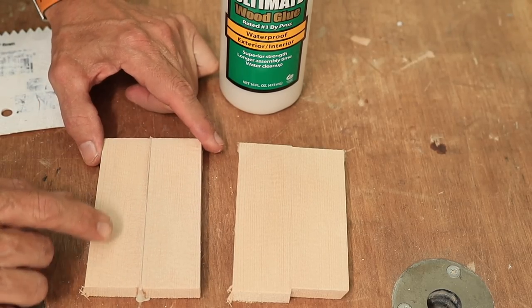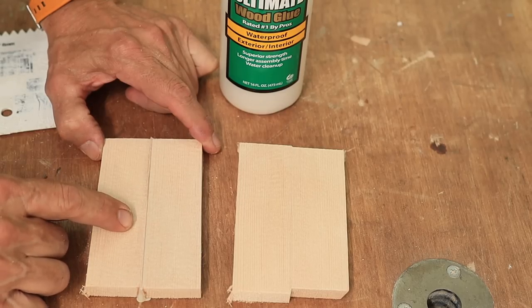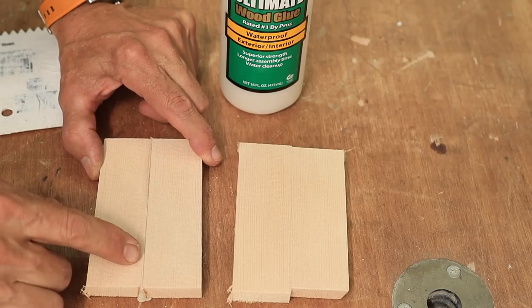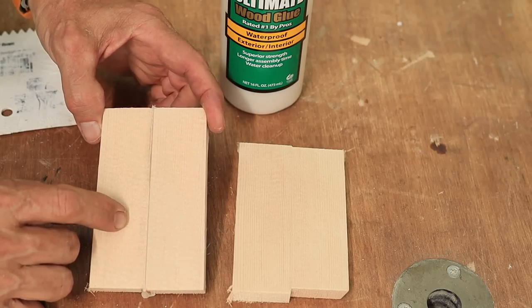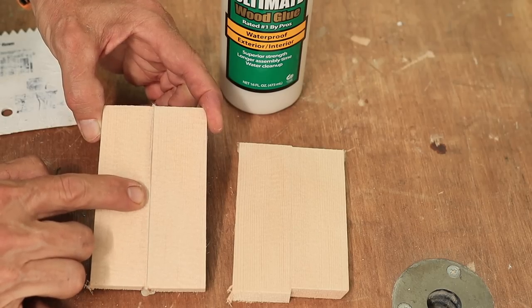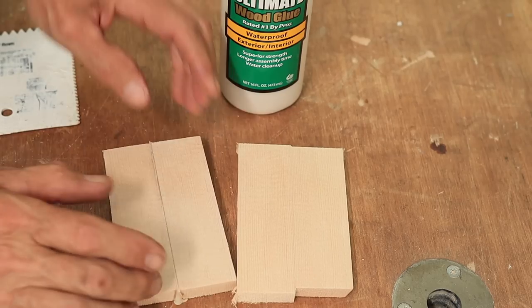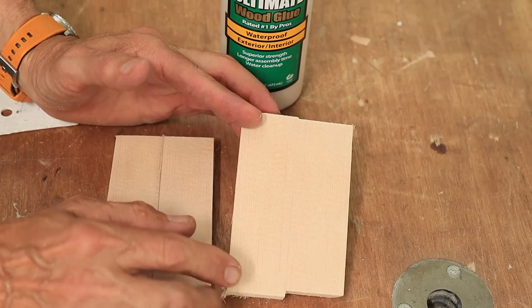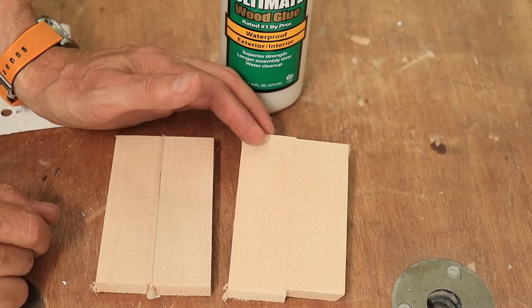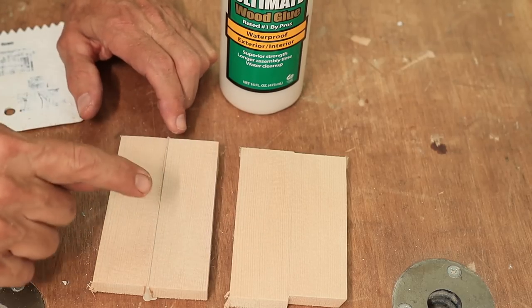But the important thing here is that we need to know that epoxy glue is a gap-filling glue. You cannot clamp really tight. If you squeeze all of the glue out, it won't work. So I clamped this so that I still had a decent coverage, and you can see the line in here. Now, both of these were sanded down to 120 grit, and you can see with the spruce here, the joint is almost non-existent. So in this application, this is a far better result than this.